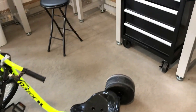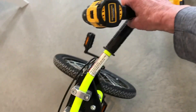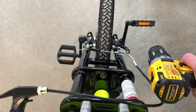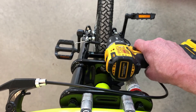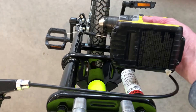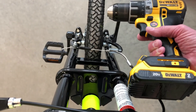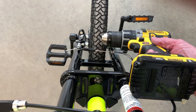I think the best way to go is probably with an electric drill. There's tons of videos on YouTube where people are using electric drills to power this kind of stuff. I like it because it'll be fairly easy to print up or manufacture a mount for it. The battery's removable, so I can charge it upstairs instead of charging in the basement. I'll either put a friction drive on, or some type of gear set. I like the friction drive because it's got a little bit of slip to it, so it's probably a little easier on the drill to help prevent it from burning out.